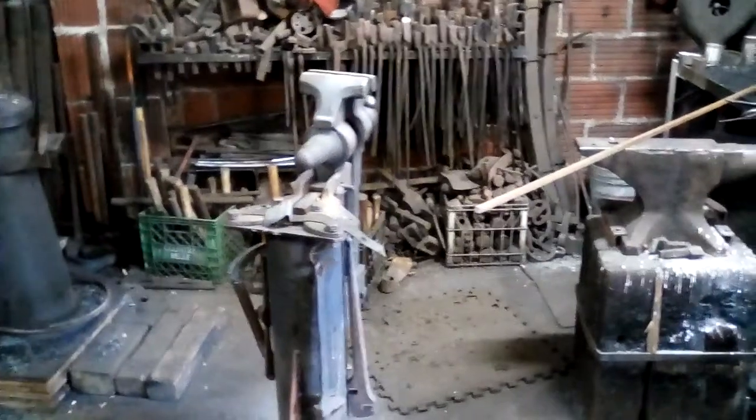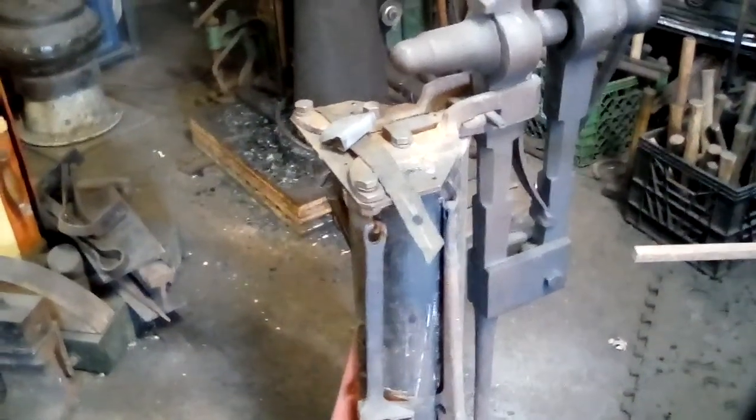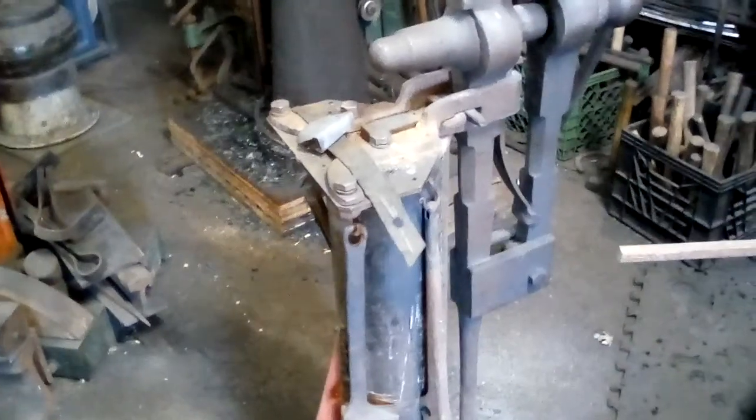That's the long anvil. It's not really an anvil. I haven't welded it together and finished it out, but when that's done, that's going to be a 900 or 1,000 pound anvil. It's got a face that's 46 inches long if you count all the way to the end of the horn. But anyway, steel pipe with flanges securely bolted into the concrete floor with 6 half-inch fasteners. The pipe is filled with scrap iron, little bits and pieces, which helps deadening.